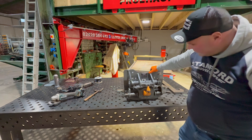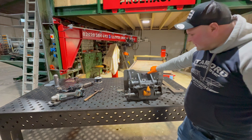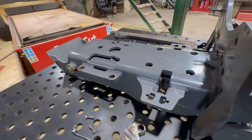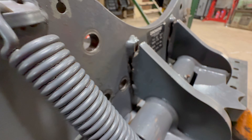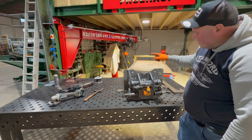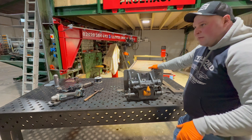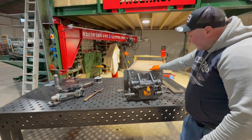So this is a rear pickup hitch off the back of a 300-odd horsepower tractor. It's been taken off because it's damaged and scrapped - if you look here it's cracked - but we can weld that up and repair it. My idea is that this is telescopic and we're going to be able to hook the trailers up. If we just had a plain hook on the end we'd probably pick the trailers up and it could jump off, whereas this has a hydraulic ram inside so we can connect it to the JCB if we want to.